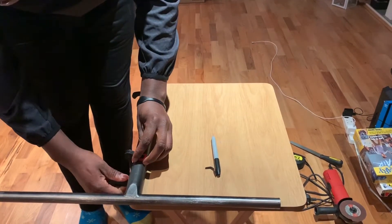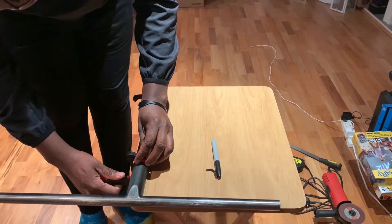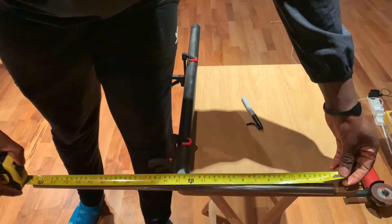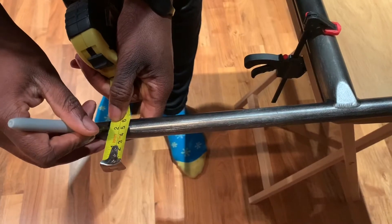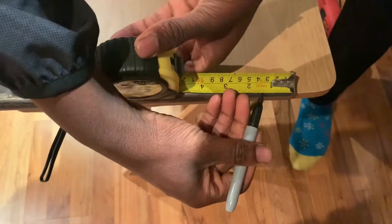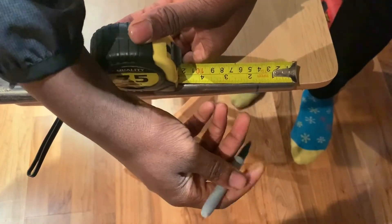Safety first — put your glasses on. Then what you want to do is make sure that your bars are secure, so clamp them to the table to make sure they're secure and in the position you need them. Now this video didn't go exactly where I wanted it to, but we're going to sort it out. The first thing I did was measure the width of the bars, and once I got that I measured out exactly how much I wanted to take off — I decided to take off an inch and a half off these, just to show you the measurements.